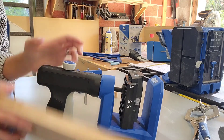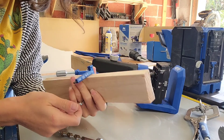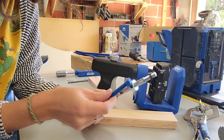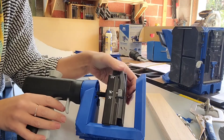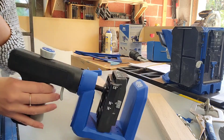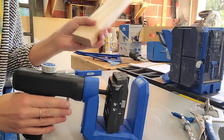Your first step is always to determine your material thickness and adjust your stop collar — I've already shown you how. Keep the thickness guide handy so you can quickly check your material thickness, then adjust your stop collar with the hex wrench, making sure the circle lines up with your material thickness. Then set up the drill block by pressing in the gray buttons and setting it to the correct spot — we're using three quarters, which is already done. Position your work piece — I'm using scrap wood to demonstrate, so I'm just putting one pocket hole in here.